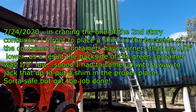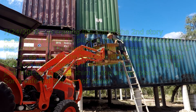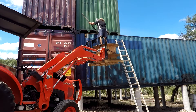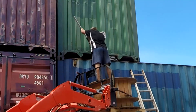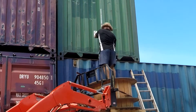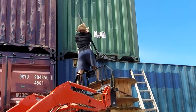After some of the sealing, I noticed that the debris container on top of the blue one - I forgot to put a shim underneath it on the backside. The corners of the containers are a half inch lower than the rest of the container, the I-beams at the bottom. So I had to jack it up and figure out how to do that without spending too much money. I basically used my two-and-a-half ton truck jack. It looks kind of safe, right? I was taking my time, going slow, slowly jacking the thing up. I wasn't quite on the corner, so it took a little more effort with the jack. Got the half-inch shim underneath it and I was good to go.